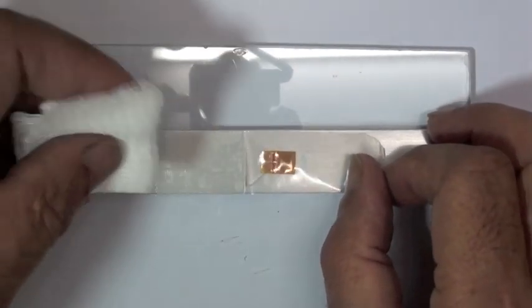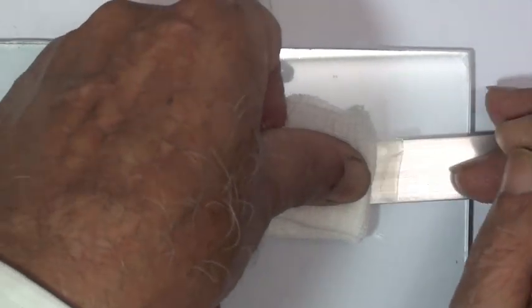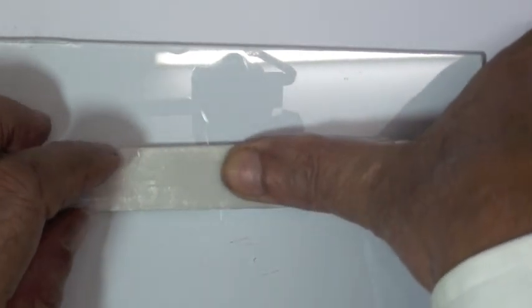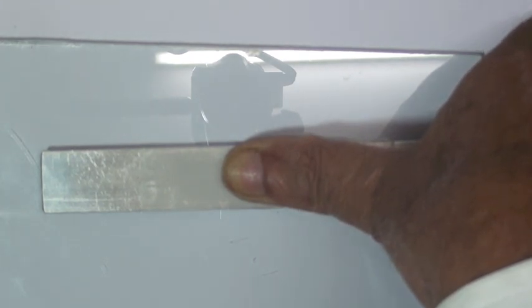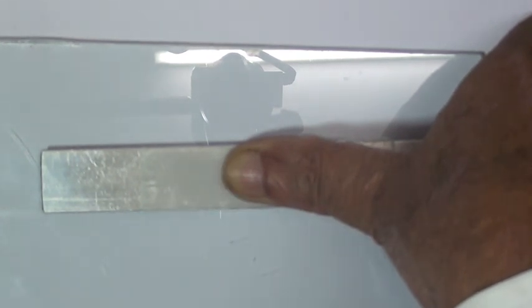And then he'll immediately get thumb pressure on this installation. You want your thumb to cover the strain gauge. And we often joke about the rule of thumb, if you'll pardon the pun, that if you have half a white thumbnail, then you're putting enough pressure on it. Yes. That's our rule of thumb.